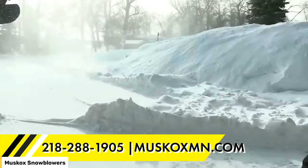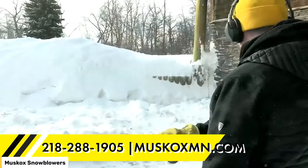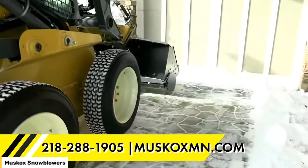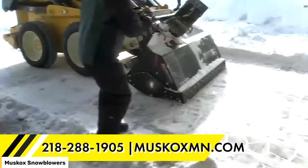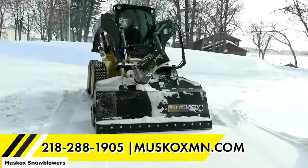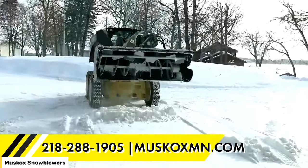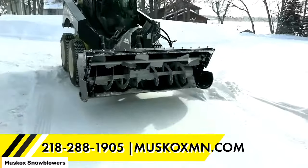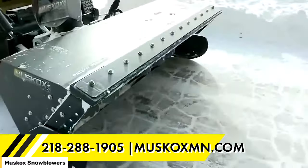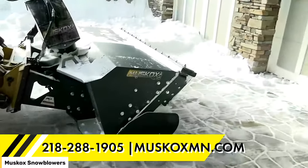Now I'd like to have Ron show the back drag feature without blowing as well, to really be able to clean up a surface. As you can see, Ron's riding on our glide plate right now — plastic is touching our surface, not steel. Watch as he slowly rotates the machine. Some operators, when they first get in this blower, naturally want to over-rotate, getting too vertical — that's not the ideal position for a few reasons.